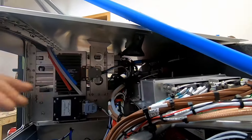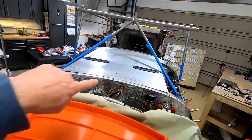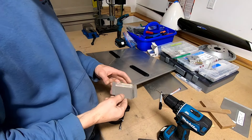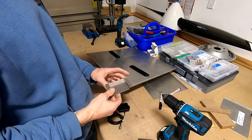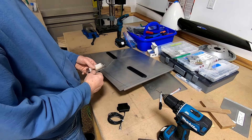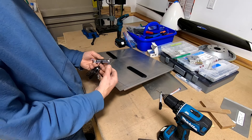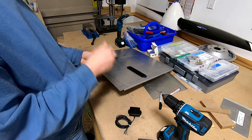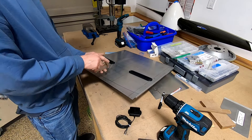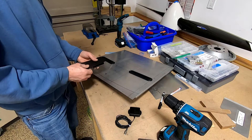Underneath there's plenty of room for a little fan to keep the air circulating and a little defrost on the windshield. Now I'll come up with something for the GPS - I've got a cool idea. So I made this little tray at 0.025 - same thickness as that - and the idea is to put this underneath. The antenna can go slide in there; there'll be a spring-loaded release tab so you can literally reach in there with one hand, pull down the tab, and pull the antenna out. It'll lock in, but I know GPS doesn't go through aluminum, so I don't want it sitting on top of the dash.